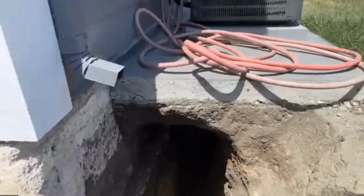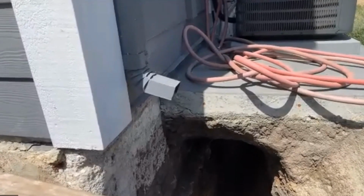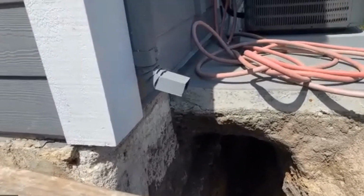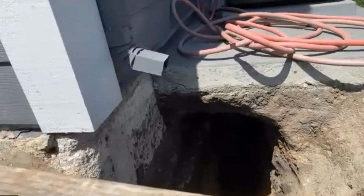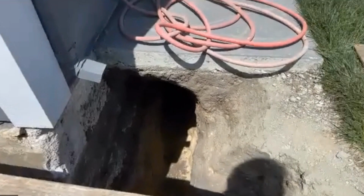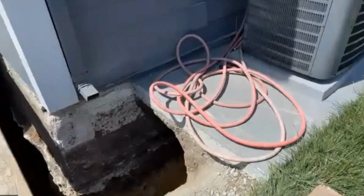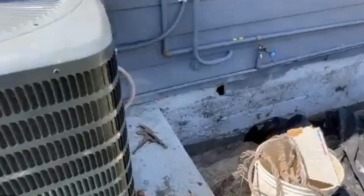That's perfect. And you can see the downspouts, and those were hooked up before, and they will be rehooked up again and separate from this system. Wherever they're discharging, they need to go separate from the system. If they want to put a new pipe in there, it can go down into the trench at any level as they backfill, as long as it's downhill.